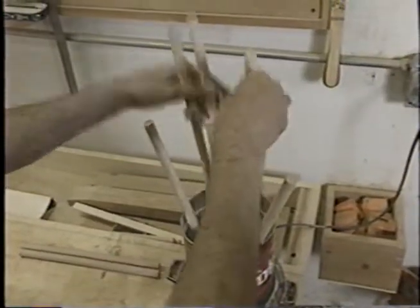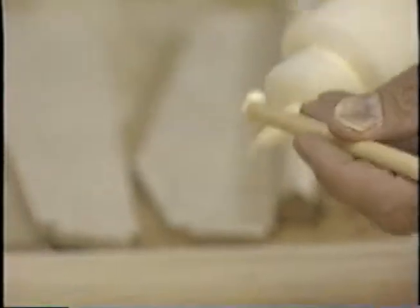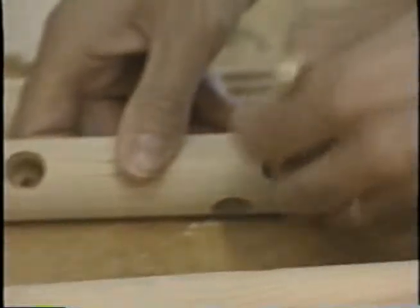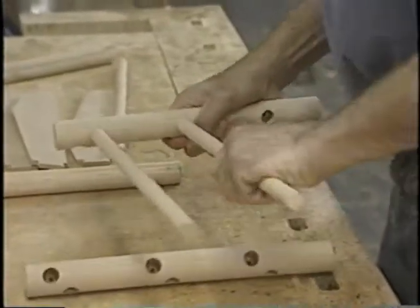I begin the assembly by getting organized, so I'll know what goes where once I'm in the thick of the glue up. Coat the entire surface of the mortise lightly with white or yellow glue. I like the new, slower setting glues because I hate worrying about the joints seizing up while I'm still fussing with them. Still, you've got to get a move on.